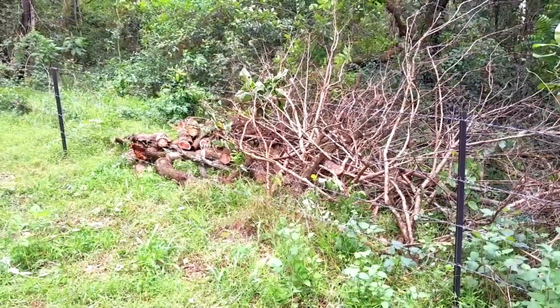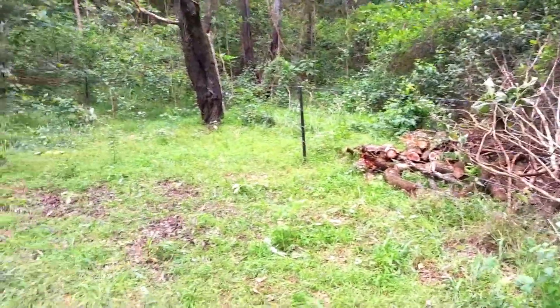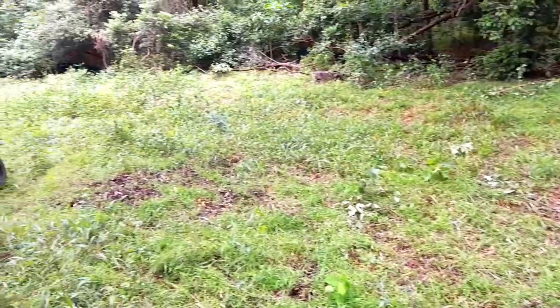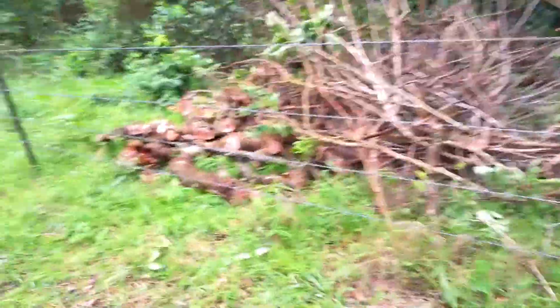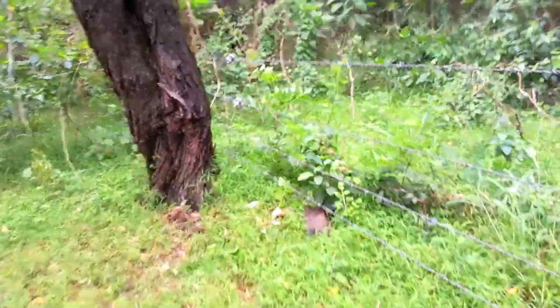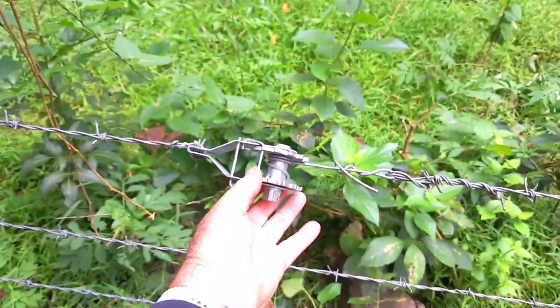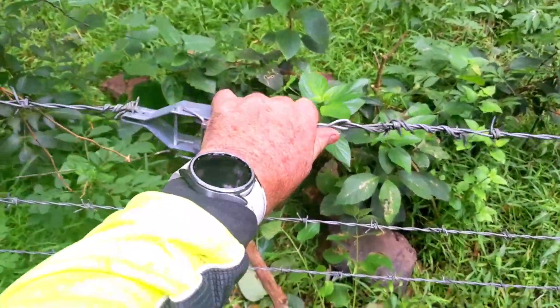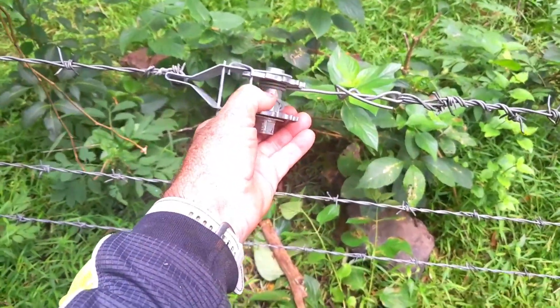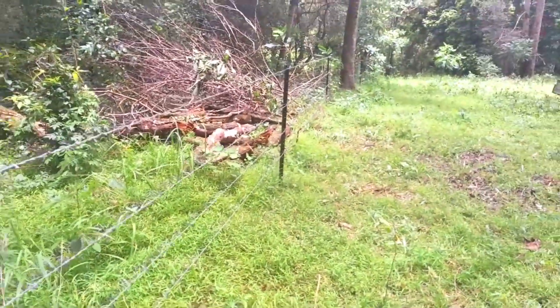Okay so I'm back - the fence has been repaired. I had to put in two winches on my top two wires and the area has been totally cleaned up. That's the rubble over there - in ten years that won't be there. I like to use these winches - just put a shifter on them, I've got a ratchet on them. Sometimes I'll use the three mil wire, it's easier on the drum. You can also use the barbed wire as long as you don't spool too much on there.